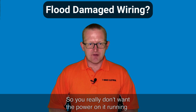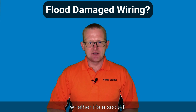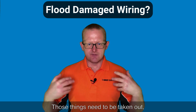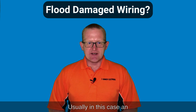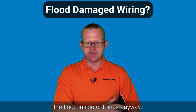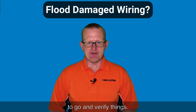So you really don't want the power running when water goes into whatever it is, whether it's a light fitting, a socket, or something electronic. Those things need to be taken out, or they need to be given the chance to dry. Usually in this case, an emergency company would come out and help with the flooding side of things anyway, and that would be done through insurance. And often they would call an electrician to go and verify things.